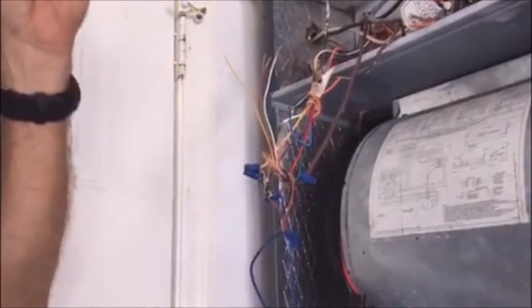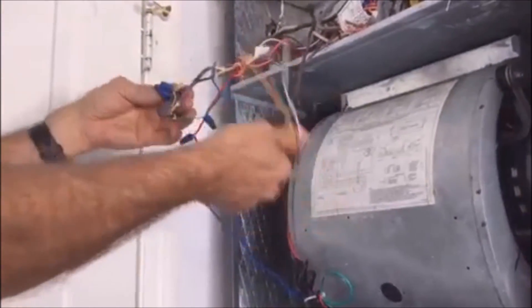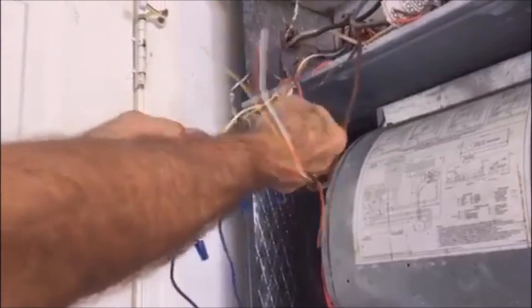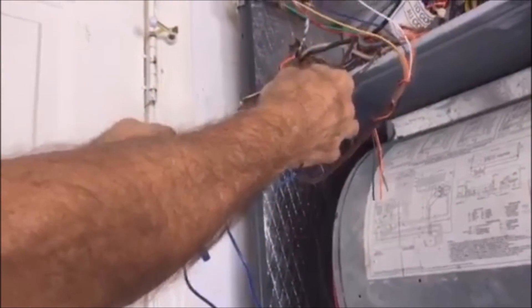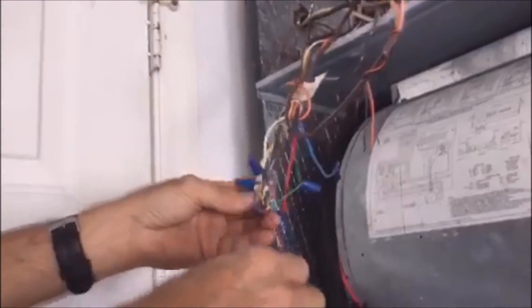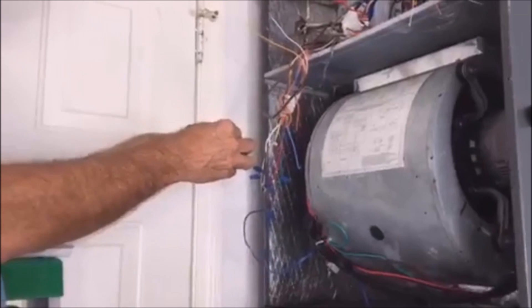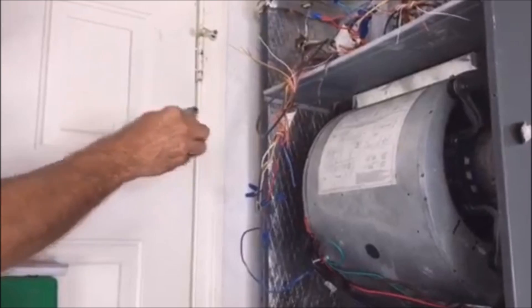The first thing I've done is gone over and shut the breaker off. The second thing is I've looked at the wiring. I'm going to pull out my camera and take a picture of it. Anything you don't need you pull out of the way — I've moved the brown and orange wire aside as that's for a heat pump system. If I need any reference in the future or have any problem, I can just look at the photo.